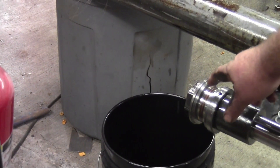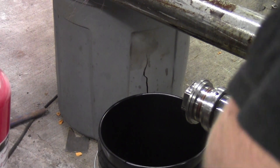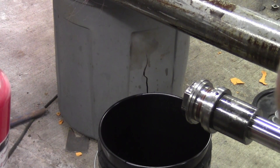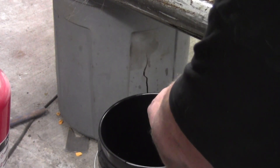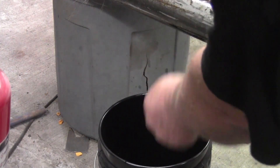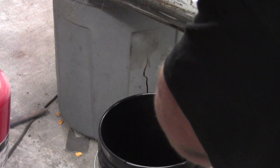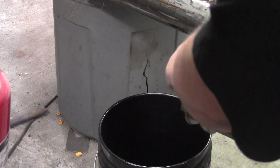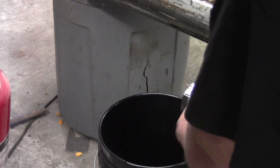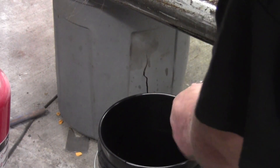The one I repacked was actually a traverse cylinder. Somebody had spun that piston out without taking the grub screw out, and destroyed the threads on the rod — it had like one thread left at the very base. So I'm going to pull this all the way out if it's not too hard. For what I need, it does not have to come out.